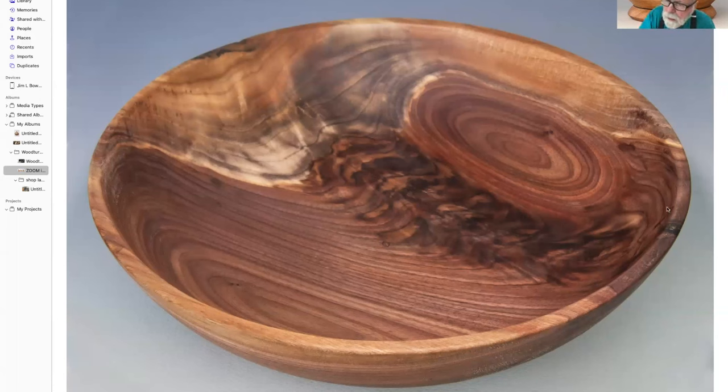The other way, Tim, is, have you got a second bevel on your bowl gouge? I do not. I use a 60 ground straight up swept back. Right. Because if you were to just take the heel off of your sharpening, that might take that part away that you're not using on the tool. Depending on how you're presenting that tool to the wood, of course.